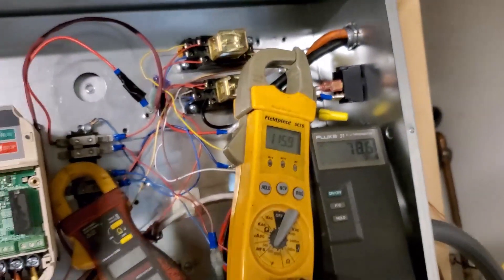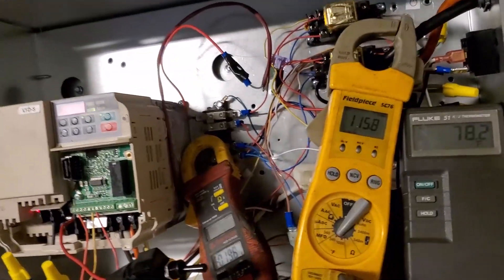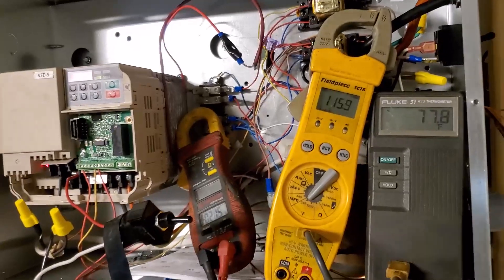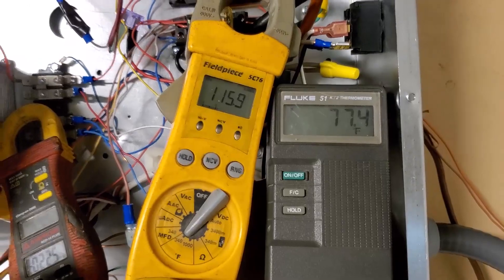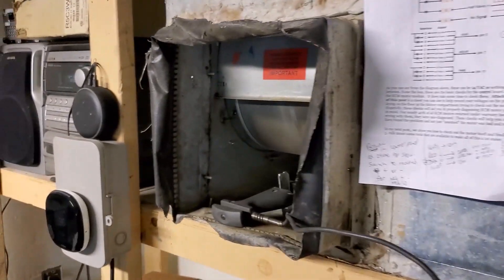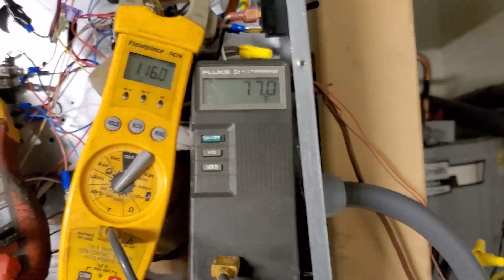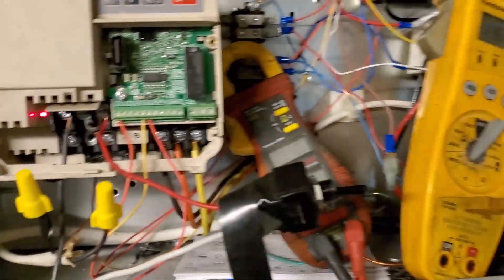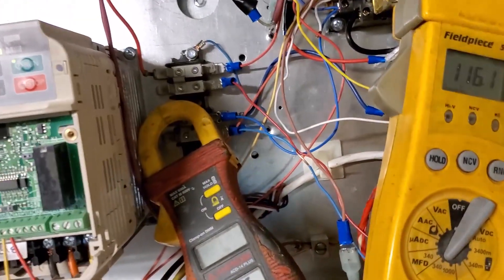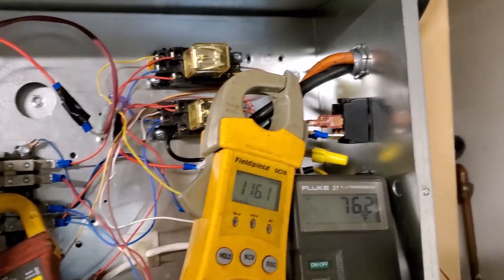Remember, this compressor is not a fair comparison to what an AC unit in the house would be running. This is running the compressor at extremes — your regular household AC started up with almost 120-degree water beating the heat exchanger and 95 degrees into the evaporator coil — you're gonna get some pressures and some amp draw on that. So it's pretty close to a 20-degree drop.